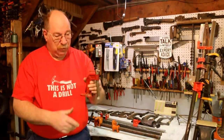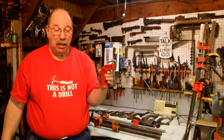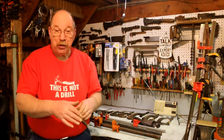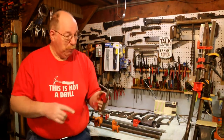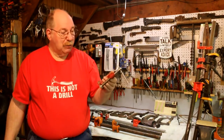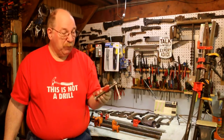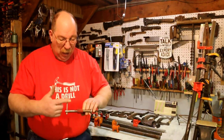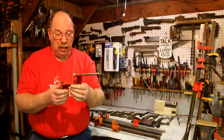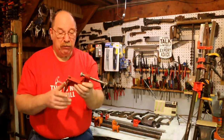And here's this little 3 inch. I showed this in a video where I put together a couple of sawhorses and put four of these clamps on them, one on each end. I used them to build windows. The original setup for making windows was two sawhorses with three pipe clamps on it. I found these at — I forget which store, it was a long time ago, wasn't Harbor Freight but something similar. They're not a high dollar clamp. The thread's nice — it's a square thread and it's got a fairly good size screw on it. The little foot there works okay. It's not a great one. It's riveted on the end.